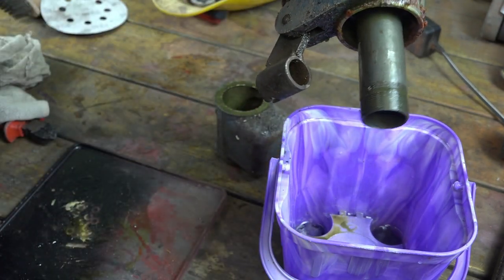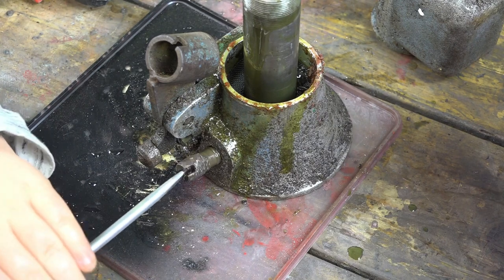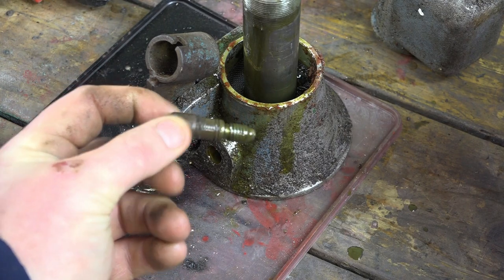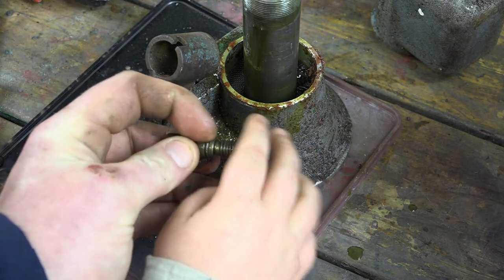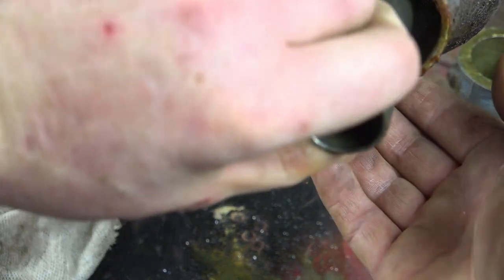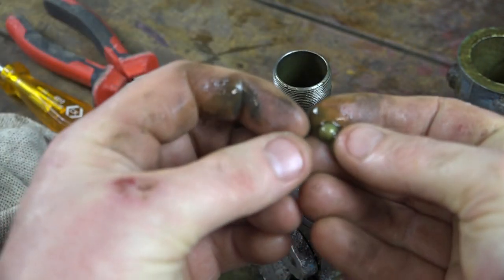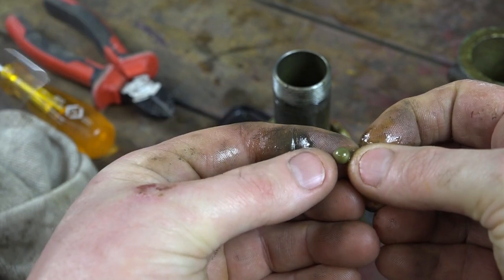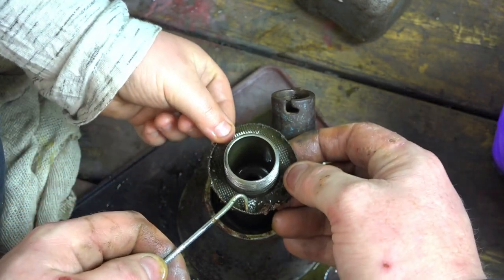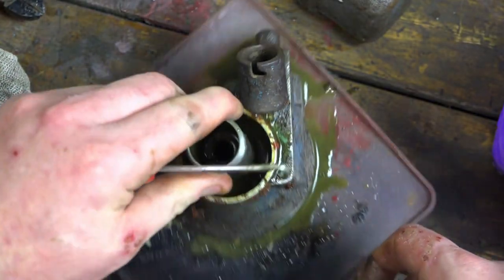Because this pump will have a small seal on it. The oil's like glue and it shouldn't be like that. Inside there - there you go - a little rubber seal. Also inside there there'll be a small ball bearing, hopefully. There it is. And that is what, when you screw the pin in, stops the oil being able to come back, so it holds the jack up. There's the gauze - that stops any rubbish getting back into the tank, because the base is the tank, what holds the oil.